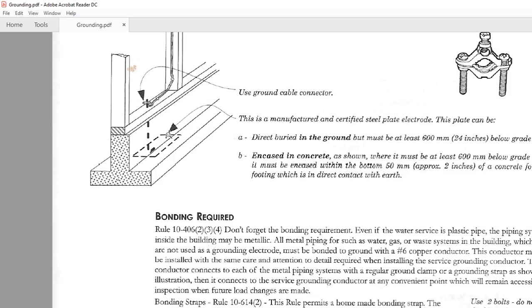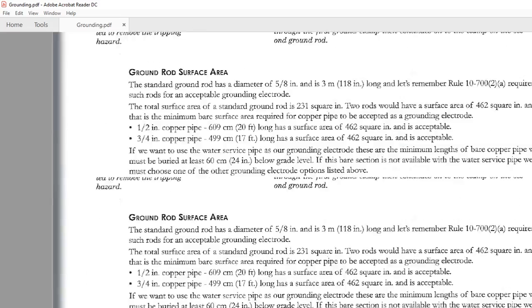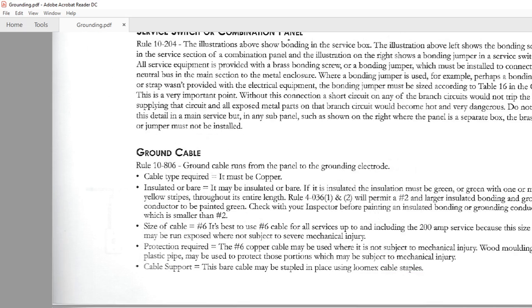I made sure every rebar was touching and tied to each other all around the house. I used thick rebars, and in some places vertical rebars were embedded into the bedrock — I drilled close to 10 inches to one foot into the bedrock. My entire house is on bedrock, so every point the plate touches is connected not only to the horizontal rebar running all around the house, but also to the vertical rebars tied into the bedrock. This is the best grounding option I found. I'll show the installation video separately, and I purchased the plate locally.